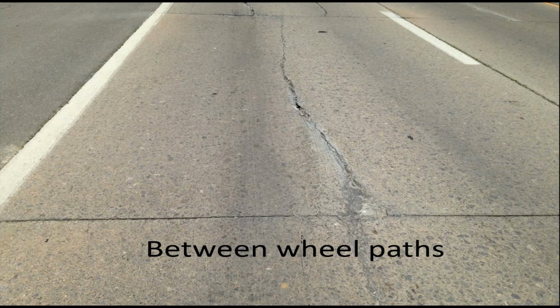There's no evidence of faulting across that longitudinal crack, so really, it's a stable pavement. All you're dealing with is that crack running down the center of the lane. It may not look pretty, but if you're trying to watch the budget and not go overboard on repairs, this is one that I would also take a pass on as far as doing any type of repair.